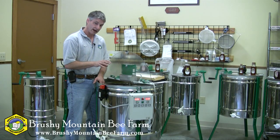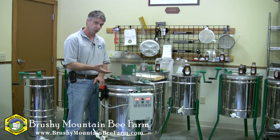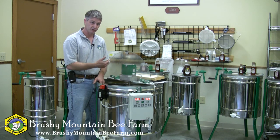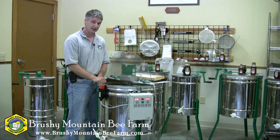When you're extracting, you do need to keep that honey gate open so that any honey that's slung from the frames doesn't pool in the bottom of the extractor but rather flows right out. If you have the gate closed, the extractor can begin to fill with honey and therefore bind up on the basket and cause undue wear and tear on the motor.